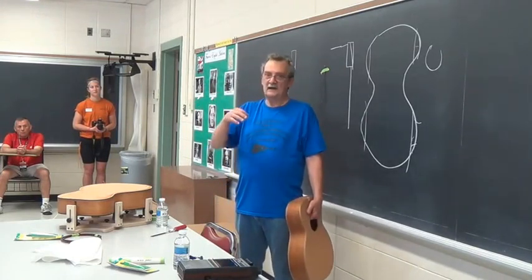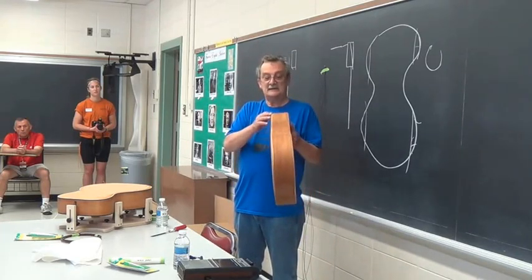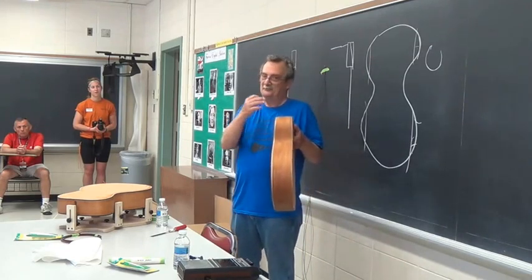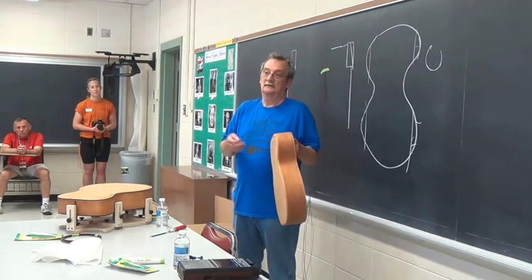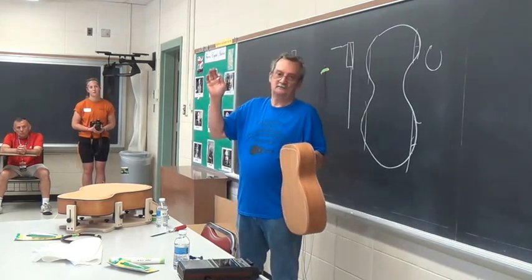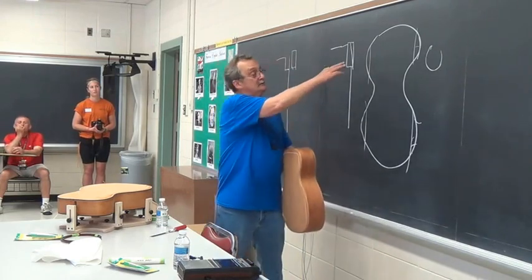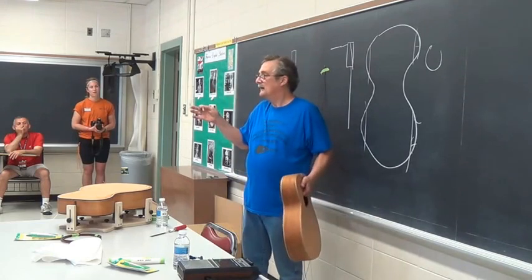I'm not a down cut guy, I just like to use a good sharp bit. You can use a down cut here because the chip is being cleared. If you aren't clearing a chip, you're probably better off using an up cut to get the heat out. But again, if it works for you, then disregard whatever I tell you. So, that is going to be the cutting direction, and does everybody hook up on that?